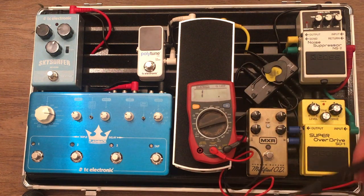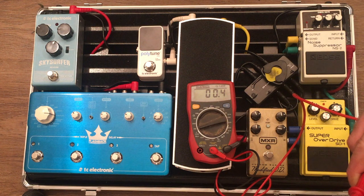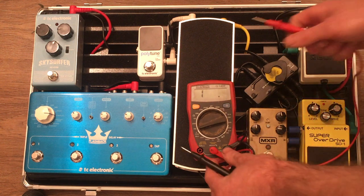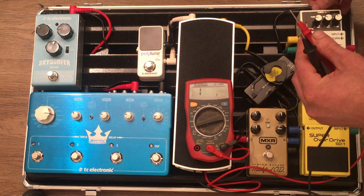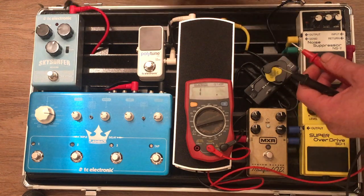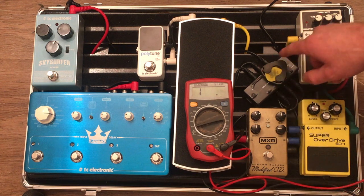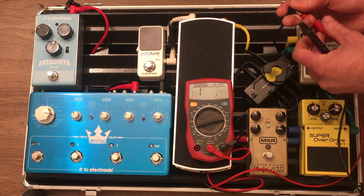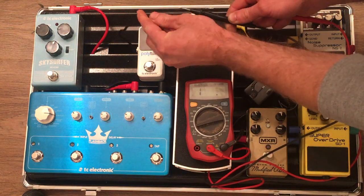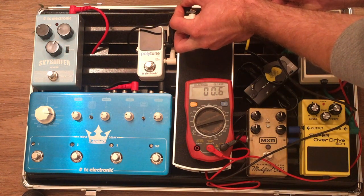This multimeter is a little bit slow, so we will hold it on for a bit until it finds its register. I'm getting 0.3 — that's what I'm getting just through the cables, which is not particularly great but at least it gives us a standing reference point. So I'm going to plug from two ends — these are connected in here. You'll notice I've put tape on those, which I said I was going to do in the last video, because the lights on it are super bright. What we're going to do first is go into the center here, and this is where I think our commenter, if he is testing this way, may be going wrong — because you'll see that we will get somewhat of a connection.